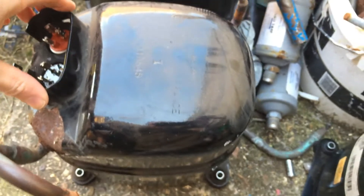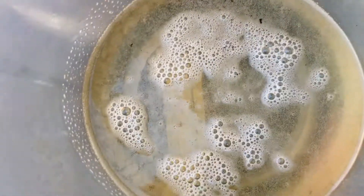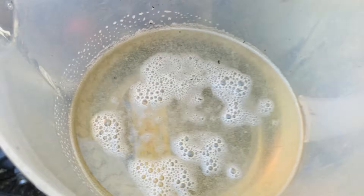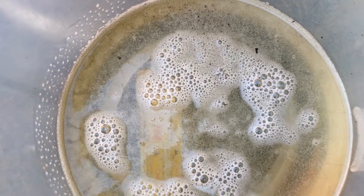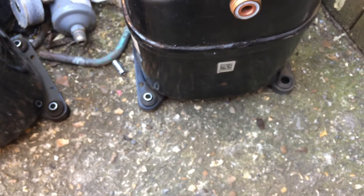And that's what's coming out of this one, which is that three-phase one, which was running fine — we just needed a single-phase compressor. So there's bits of rust that's just fallen in, but you can see how nice and clear that is. There was still some dirtier oil left in the bottom, but yeah, that's how it should look. Something major has gone wrong with this one.